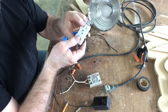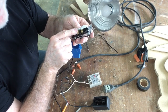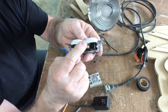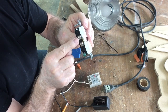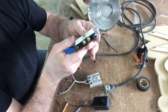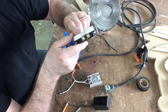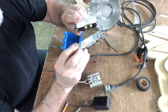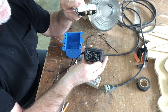What I need to do — and I talked about this in a previous video — is you can actually break this little pin right here. I'll get that into the camera so you can see it. That will actually separate these two plugs. I only want to do it on the power side. By breaking this, it will allow me to have power coming to one side of the plug all the time, and on the other side, add a switch to control and turn it off and on. That way, I do not run power all the time through my AC-DC adapter.